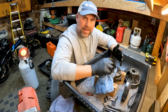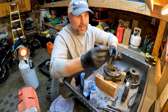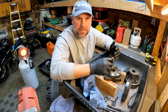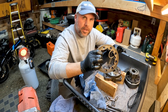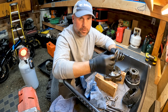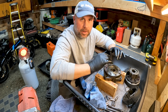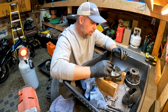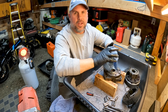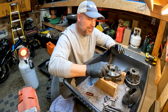I'll post the original problem in the comments once I find out. I just kind of wanted you to tear this down with me to let you know what we're looking at inside these motors — there's no magic, nothing to be scared of, it's very straightforward taking these apart and putting them back together. This backup ring and this O-ring — that's usually what the problem is, especially if the geroller is good. We can rebuild this motor for about 75 to 80 dollars. If the geroller section is bad, you're looking at about 1,200 dollars for that section — that's when it may or may not be worth it. But for just resealing, absolutely — I'll rebuild this all day long, because a new motor is around two thousand dollars. Let's get this all cleaned up and we'll get it put back together next week. Thanks for watching!